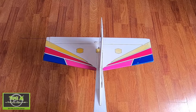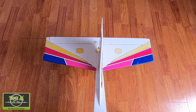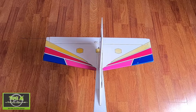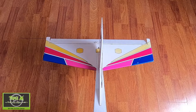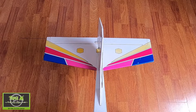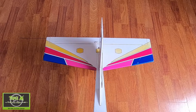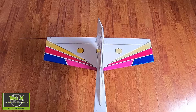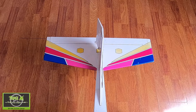What I found out is that they say to disable the rudder. The problem is when I disable the rudder and bypass the stabilizer — putting the rudder directly into the receiver — the stabilization system won't initialize when you first plug in. Rudder, elevator, and aileron respond fine. But when switched on, the rudder stays deflected, which would be dangerous in mid-flight.